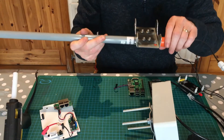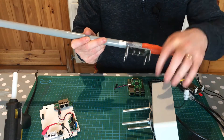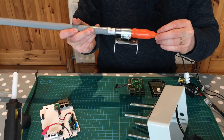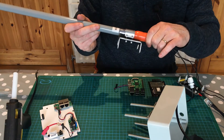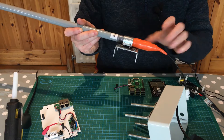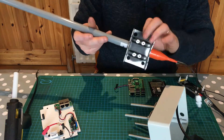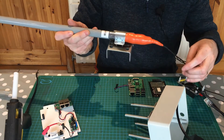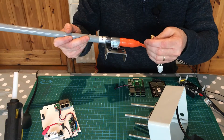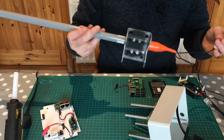I mounted the antenna onto the back of the bracket to save tightening eight bolts rather than four — so it's all in one solution. On the front of the bracket is the waterproof box, which is IP65 rated. I've used mastic tape: put on a layer of insulating tape first around the joint, then a layer of mastic tape, then another layer of insulating tape. That's properly waterproof. I drilled a few holes in the back of the bracket, gave it a paint to slow rusting, and it comes onto a little pigtail with an SMA cable suitable for the RAK831 LoRaWAN gateway.